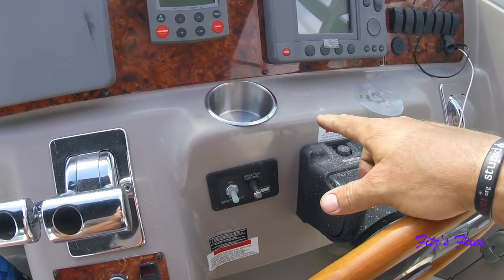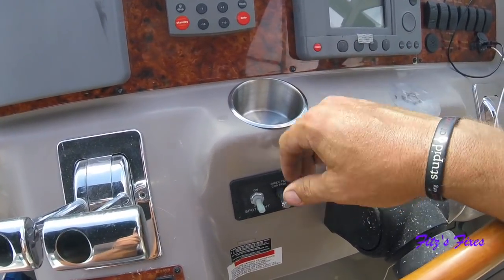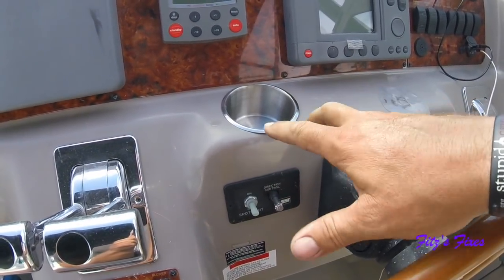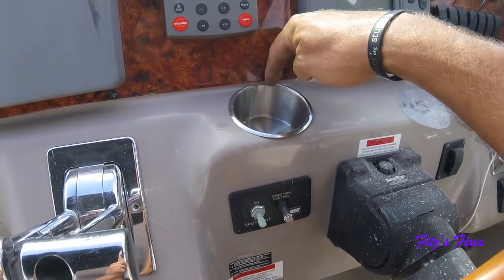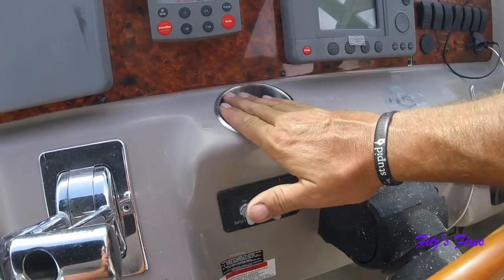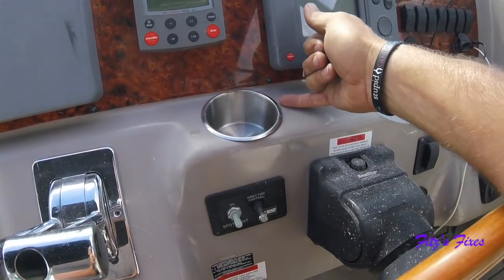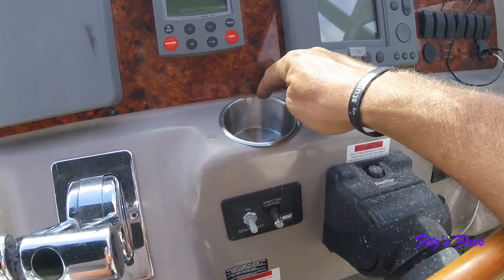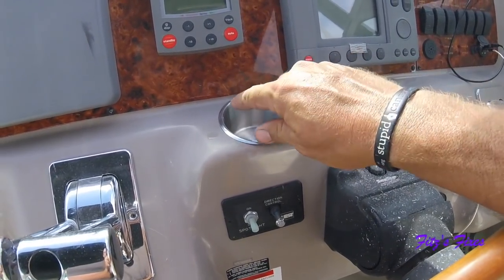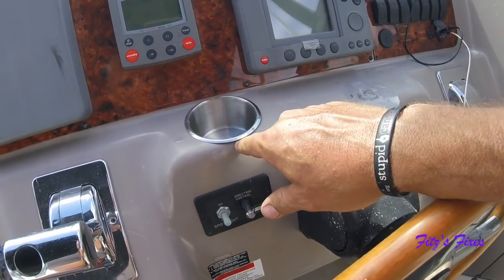I got the hole drilled out. It went fairly easy, no big deal. Measurement was correct. I got it back as far as I want, but I see where I cut it flat in the back. I have it turned a little too far this way, so I have to pop it out and turn it back a little, because I have a gap here and nothing here, so that part is hanging up on this radius. And this little gap right here, I don't think I'm worried about.